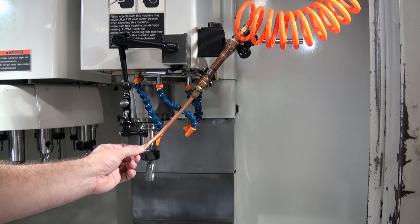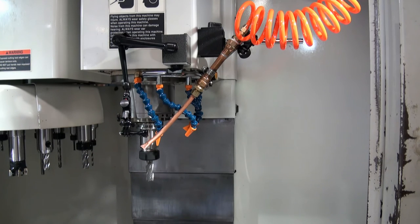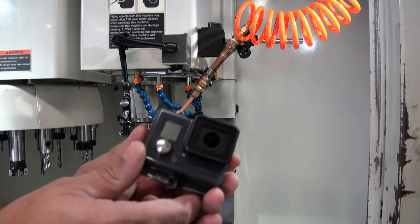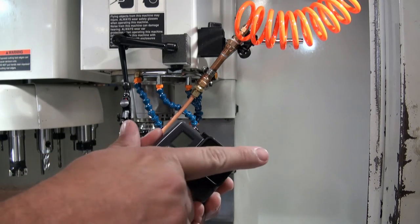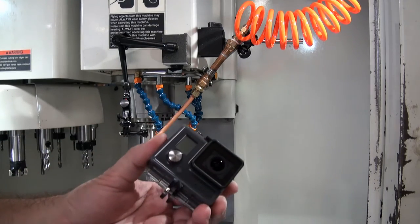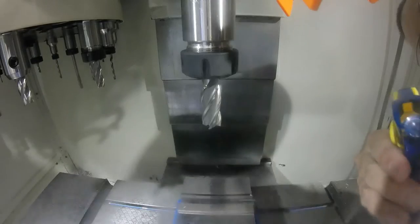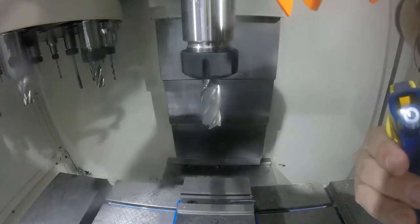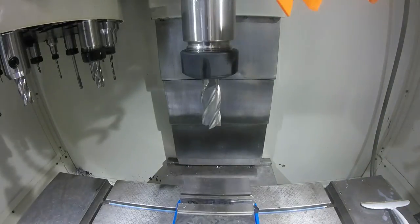I don't use a lot of pressure — it's only running at about two or three PSI — so it doesn't flow a lot of air, but what it does is make a really high-velocity stream. On the GoPro, it's pointing at the corner of the lens and just kind of pushing across it, and the fan tip clears off the whole lens. Testing it, I just squirted it with a spray bottle — here's some coolant on the lens — and you can see that as soon as the coolant hits the lens the air blast just pushes it right off. I think this is going to work very well.